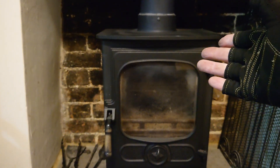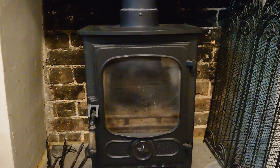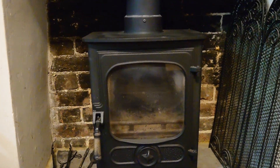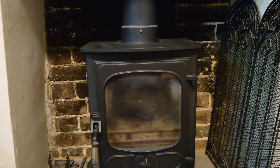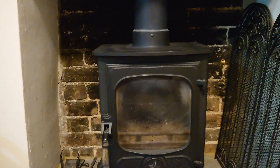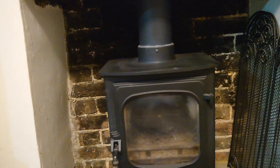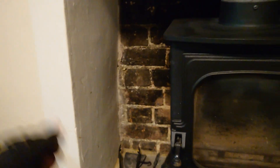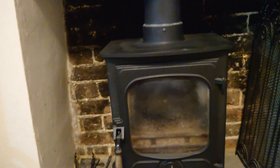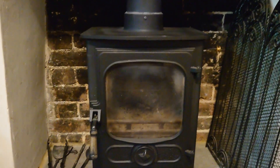The difference between a wood burner and an open fire is that open fires don't have a baffle plate - you can have one made up. I did an inglenook that had a terrible draft, and I put a massive damper plate inside there. It's about six foot wide, took two of us to put in, weighed a ton. It's got a chain on the side with a hook and you pull it down - you can use it as a throat plate, which is fantastic, and then close it right down when you're not using it.